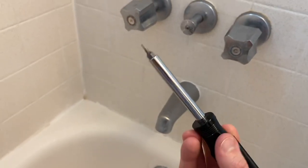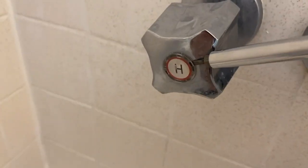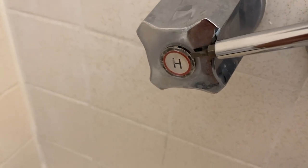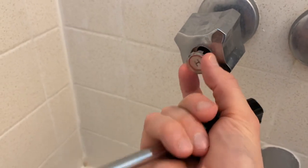I've got a very fine flat head screw tip and I'm going to carefully insert it in the cap here. Each cap should have a little gap or slot — see it right there? Find it on your cap, carefully push your cap out and set that in a safe location. Inside there is your Phillips screw.